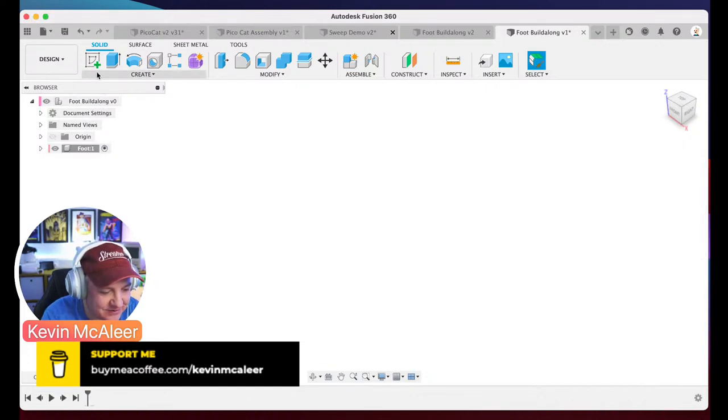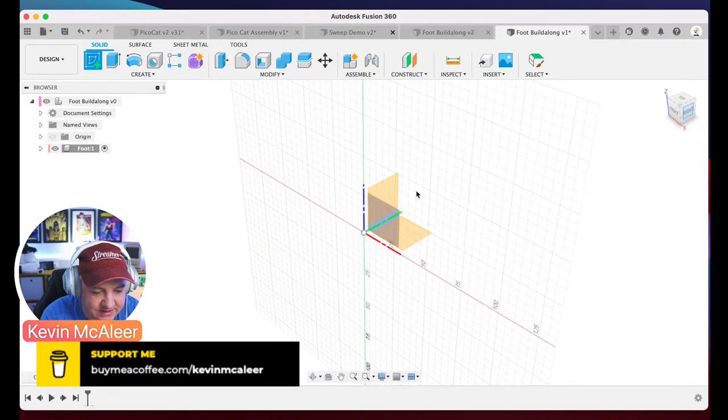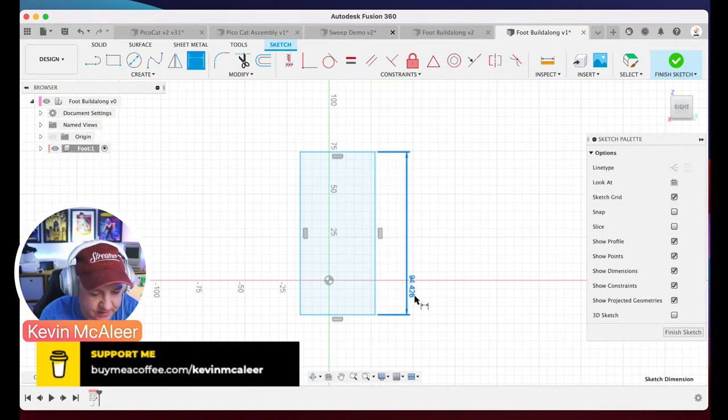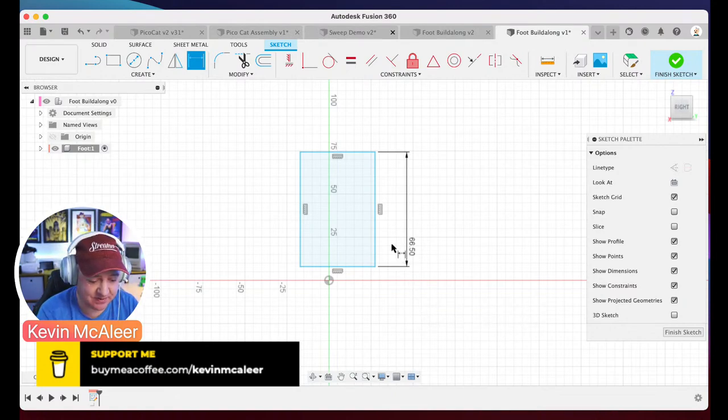And then what we want to then do is just create a, let's go for the same side. So right side and just there, right. So it's going to be another rectangle. So that's going to be 66.5 by, I think it's 19. Right, so let's try using the derive command. Excuse me, I've actually designed this before. And I might not be able to remember what these things are.